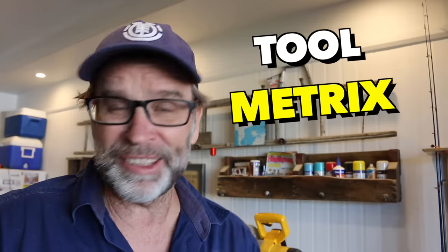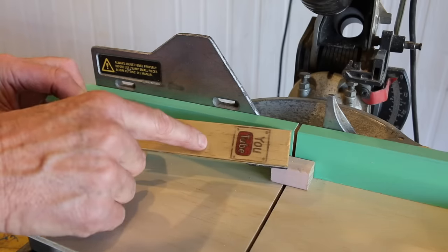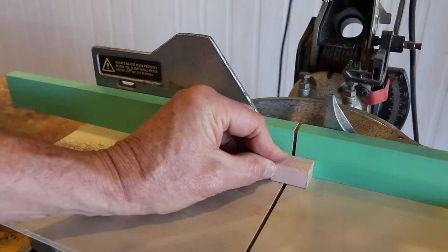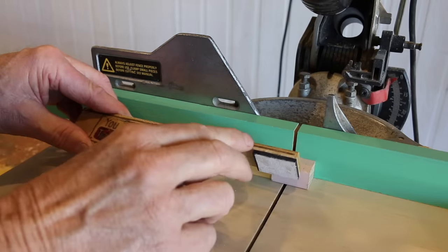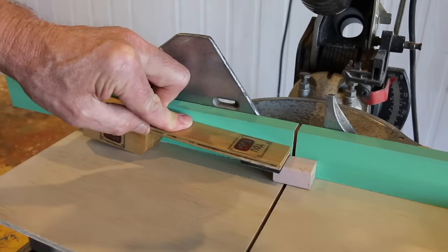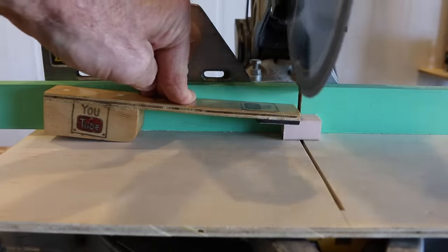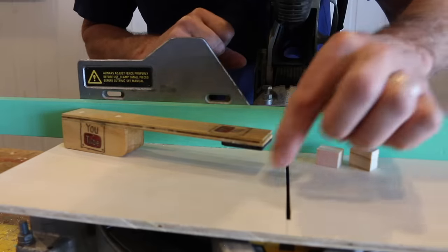This next tip is absolute genius and has to do with the safe cutting of small pieces of wood with your mitre saw. I actually stole this idea from the guys over at Toolmetrics, so I've got to give credit where credit's due. What a cracking little jig. I have plans to make one of these down below in the description box. The issue with cutting small pieces of wood is that because your fingers are so close to that blade, it makes it incredibly dangerous. With this jig, I've glued a rubber pad to the ply and then glued some sandpaper to that rubber pad. That allows me to apply pressure to the top of that piece of wood, holding it safely in place — at the same time keeping my fingers a safe distance away from that blade, making for a safe cut. It's also important to have that zero clearance plate in place when using this jig.